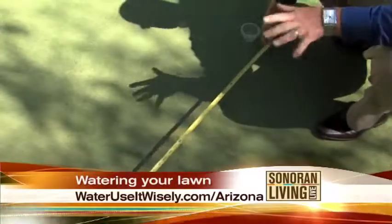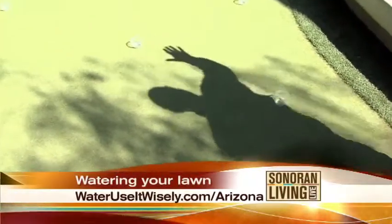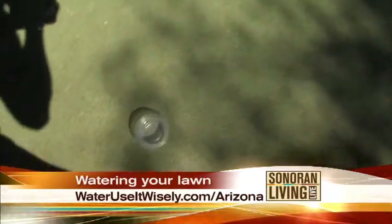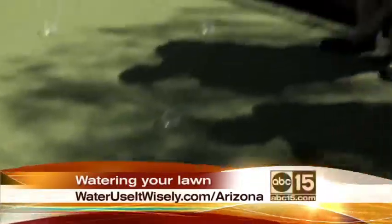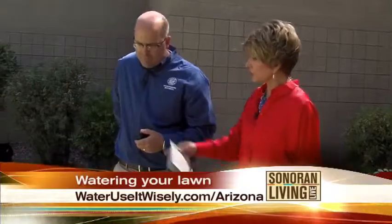You put these out, turn your irrigation sprinklers on for about 15 minutes, stop it right then, then go through and measure how much water you have in each one of these catch cans. What you're looking for is uniformity — you want to have the same amount of water in each can. It won't be perfect, but watch for big differences: if you have an eighth of an inch in one and three quarters of an inch in another, you have a problem. That means a sprinkler adjustment needs to be done. That's a really easy tip we can all do ourselves.